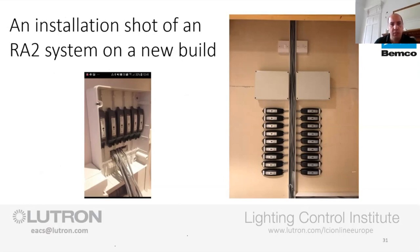Don't do that with an 18-arm chandelier, obviously, because you're going to need a pad at the back of there, and you could end up with lath and plaster everywhere if you try and hang that off of a Euro fast fix box. But yeah, there's plenty of options there.